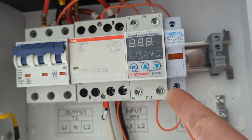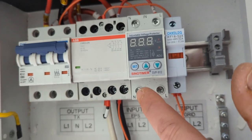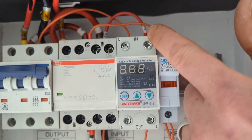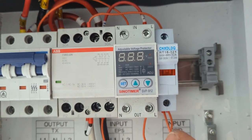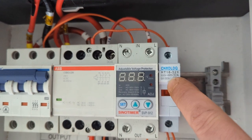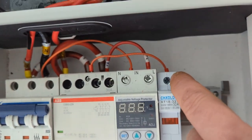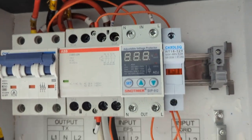So it comes out — and remember these voltage protection relays only switch from here to here; this leg is a pass-through, always connected. As the voltage protection relay turns on, it will connect this to this, which comes out and heads through a fuse — only a one amp fuse — and comes up into the A1 side of the contactor.